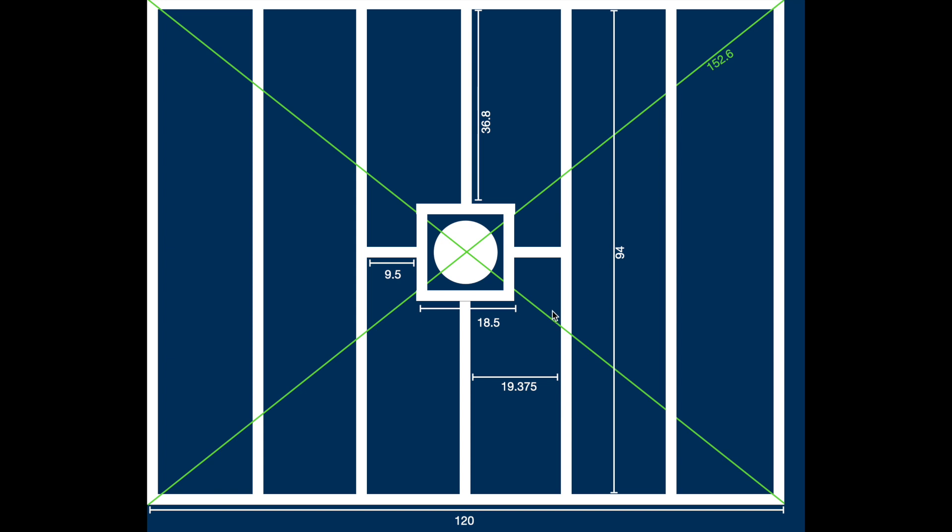Now that I've established I'm going to use a 12-inch diameter pier, I can see how this fits into a floor plan for a roll-off roof observatory. I looked at a couple of different designs and settled on a basic design from Skyshed, which I can't show here because of copyright limitations. In general, this is the floor and joist layout for an 8 by 10 foot roll-off roof observatory. With a 12-inch pier centered in the center, I would have a diagonal of about 152 inches. The question is how does this play with the telescope and my provisional pier height?